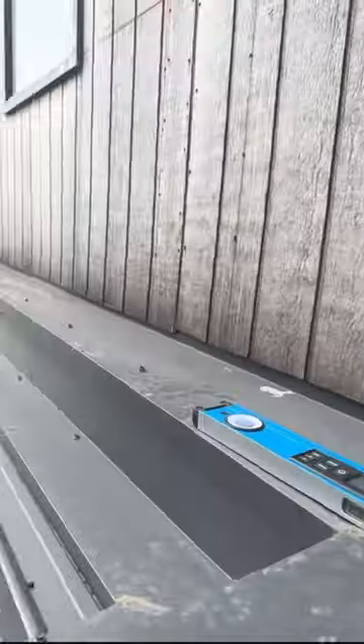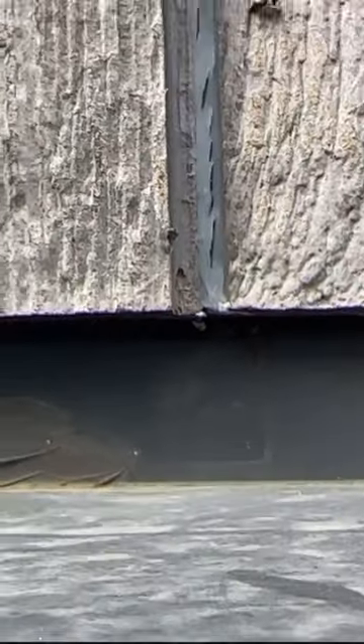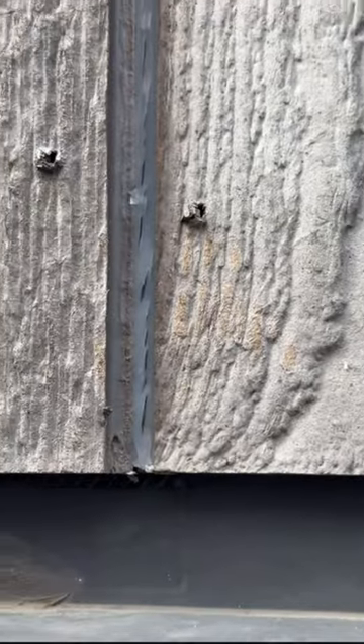Here's some damage. On the lower roof you can see they did use a DPC right there — that little black plastic. And then they've siliconed the rest. Obviously they couldn't be bothered cleaning the boards or painting them. Look at these butt joints — horrible chip. They haven't even painted and sanded the timber work.